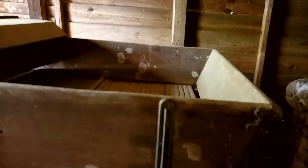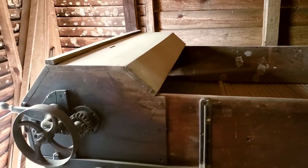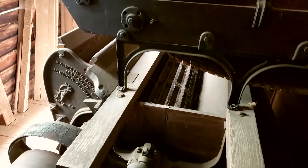So the first step: after cotton enters the gin house, it's poured into the feeder at the top. The cotton moves along the conveyor belt and then down into the gin stand at the other end. The purpose of the feeder is to control the rate at which cotton enters the gin stand to prevent clogs.